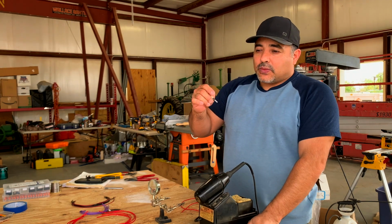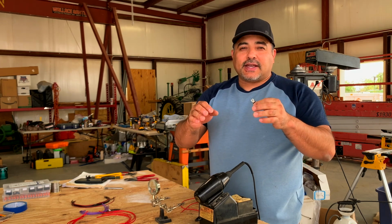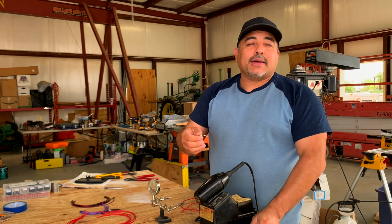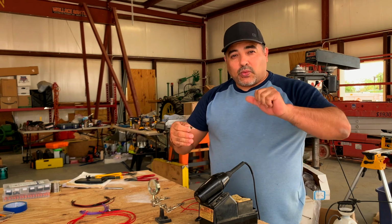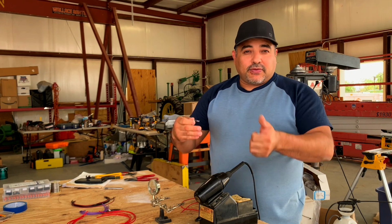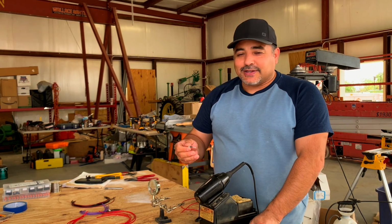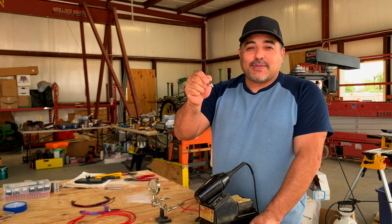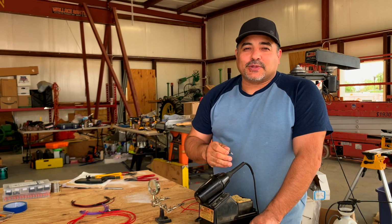And so what'll happen is then one switch will toggle multiple of these MOSFETs and turn them on kind of at the same time. An example of that is in the front, where we have 2 sets of living room lights that we want to toggle on. The one switch will toggle both MOSFETs and turn them both on, but then if we turn it off, they're independent again to be used with the home automation. So it's a little bit weird. This is what we're doing for manual overrides. We're going to have to make a bunch of little wires off these MOSFETs, get them ready to go, and hook them up to a switch.